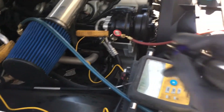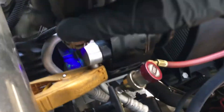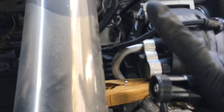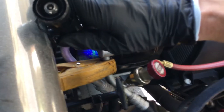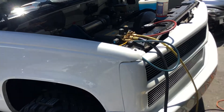It was taken completely apart and immaculately cleaned, but somebody put dye in there before me. You can see a little bit of evidence of the dye — it's just barely leaking bubbles, and they almost stop. Right where I said from video number one it would be leaking, it is. They steam cleaned, which is good, but they didn't steam clean way down near the compressor. There was old dye down inside there, so somebody was looking for leaks before. This had a known problem that was not taken care of.